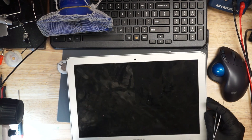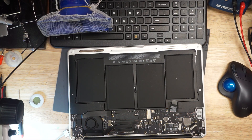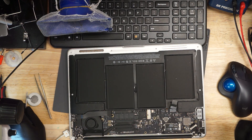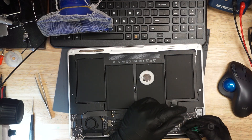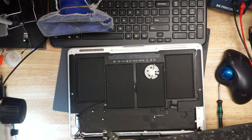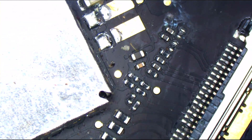Why is it that the screen is not turning on? I want to close the case of this MacBook, unplug the MagSafe, take the screwdriver, and take the screws out. I'm going to find out where they hurt you. The board has been taken out of the casing. Let's take a look at what our backlight circuit looks like. Our backlight fuse has seen better days — that looks quite dirty, and our connector looks very disgusting.